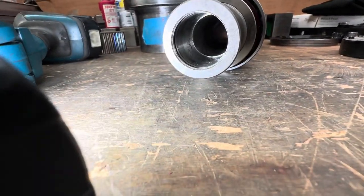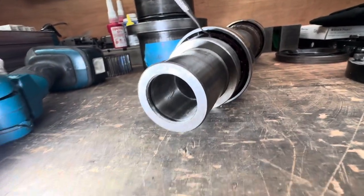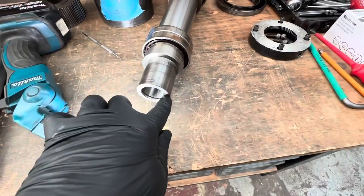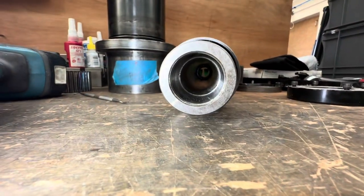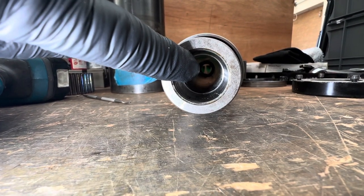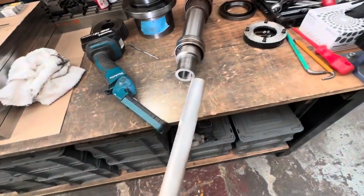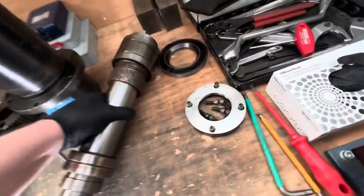So I think this is a press fit, shrink fit top hat that is pushed down to compress and hold on the bearings. And then you've obviously got your spacers in there. So you can't grab or pull or push on this, because this is the part that you're trying to get off. So I'm thinking, don't know if you can see right down inside there, there is a shoulder or like a counterbore section that, if I take this 32mm bar, which basically imitates the draw tube, it will sit down on a hard stop.